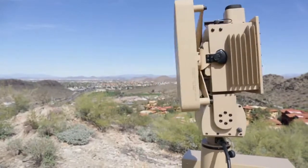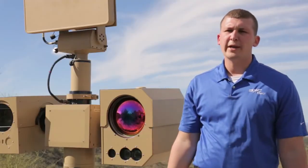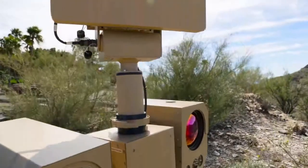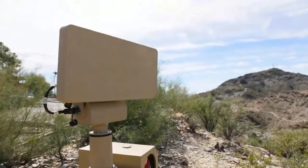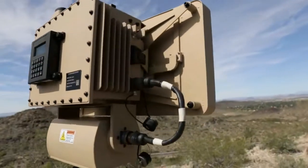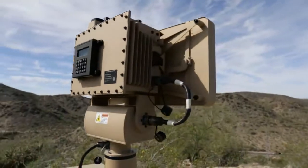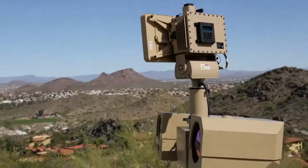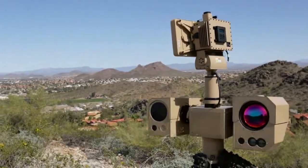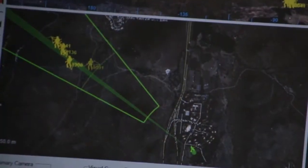The SR Hawk V2 Enhanced is a lightweight, low-power, long-range ground surveillance radar. It can be assembled with no tools, and in under 5 minutes you can be operational. It has a built-in GPS and electronic compass that allows for self-emplacement and GPS timestamps on detections. It has the capability of detecting a single walker at 12km and a vehicle at 30km.